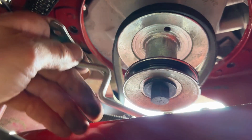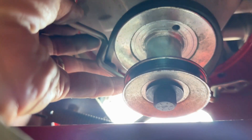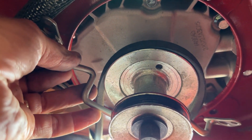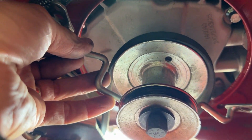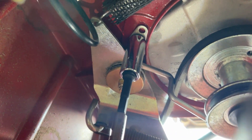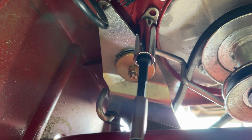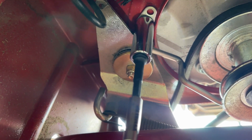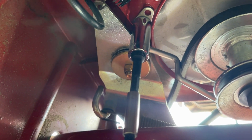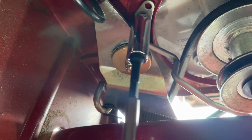When you put this in, you also have to put this belt guard, which goes right here like this — it'll go right up in there and then into the other one over there. A little tricky to manage the camera and two hands, so I'm going to put the camera down while I screw that in — at least get it finger tight. I found it easier to stick the driver through that hole and up in there, just kind of push. Maybe move the engine just a little around, and you'll see it'll grab just like that. It's in there. Back it up just a hair — it's loose but still on there.